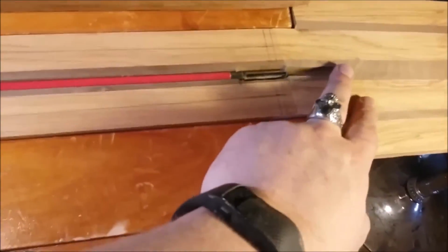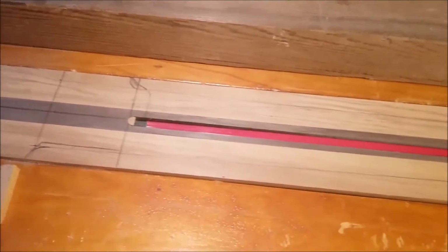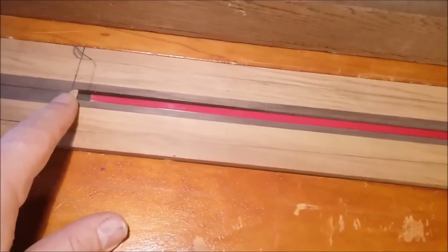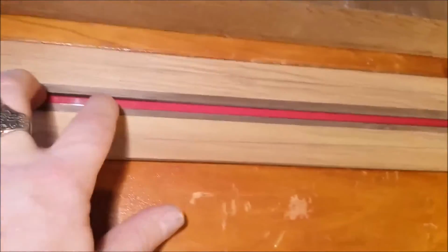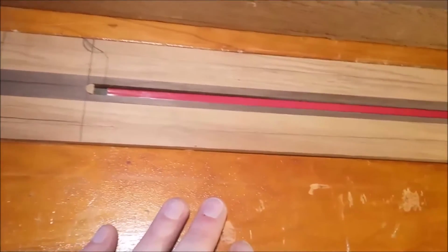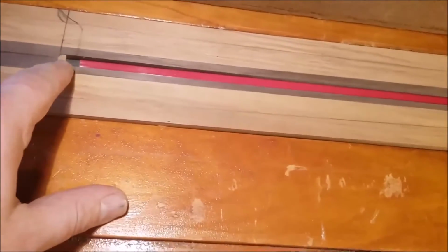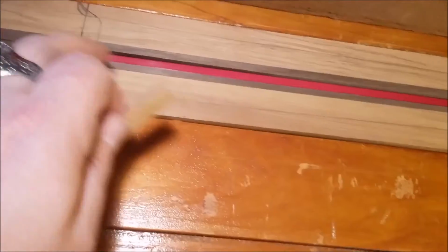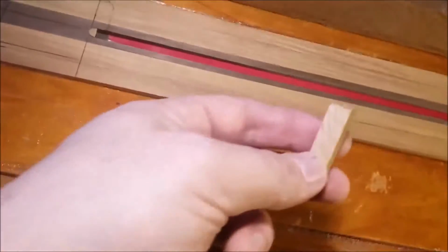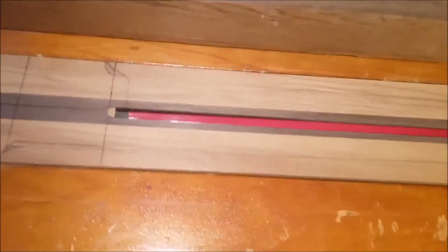I might make that look a bit nicer there where the access is. One thing I inadvertently did is make the channel ever so slightly longer than I needed to, from the tip at that end to the end of the adjuster at this end, so that it would actually move slightly, and you certainly don't want your truss rod rattling around inside your neck. That would be terrible. So I have filled the space there with a piece of matai. Even on jobs that no one's going to see, use quality wood. Well, you don't have to, but you should. Take some pride in your work.